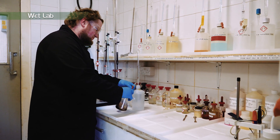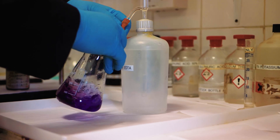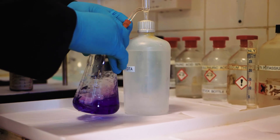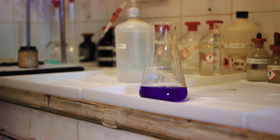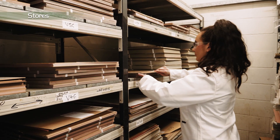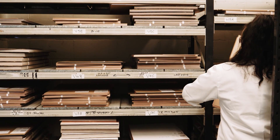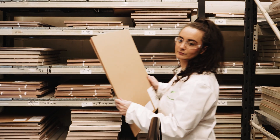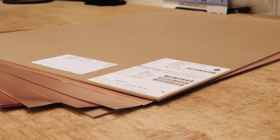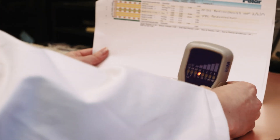The chemical solutions present in the production lines are regularly analysed to ensure they meet the stringent levels determined by the suppliers of the process. The laminate and prepreg specified on the route card is pulled from stock, checked for compliance and released to production. The batch codes are recorded on the build sheet so material traceability to source can be maintained.